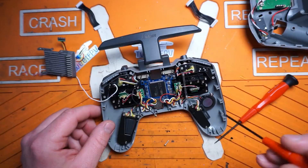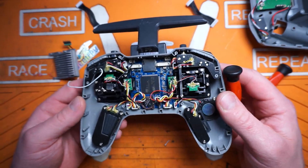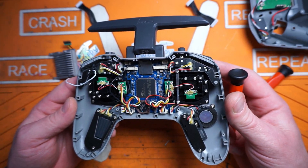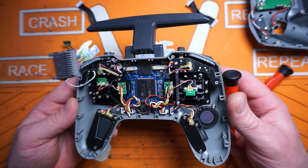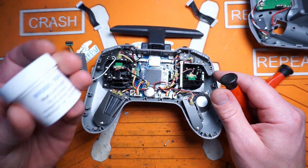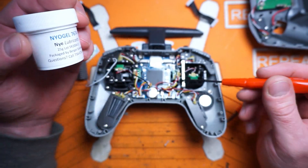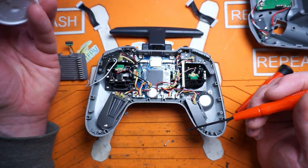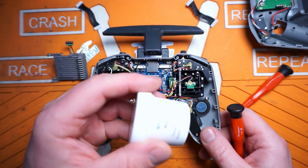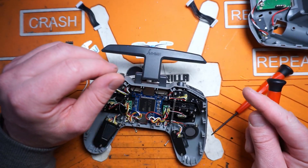Go ahead and pull more wires off, and we see we're left with our gimbals under here. I'm not a gimbal snob, but I do know when some gimbals are better than others. The throttle at least has almost like a clunk to it — right about there it gets stiff. Something I've done in the past to clean that up is to put a little bit of Nyogel 767A on the contact points, and this makes a huge difference. I'll put a link to this stuff in the video description if you want to pick yourself up a lifetime supply of Nyogel.